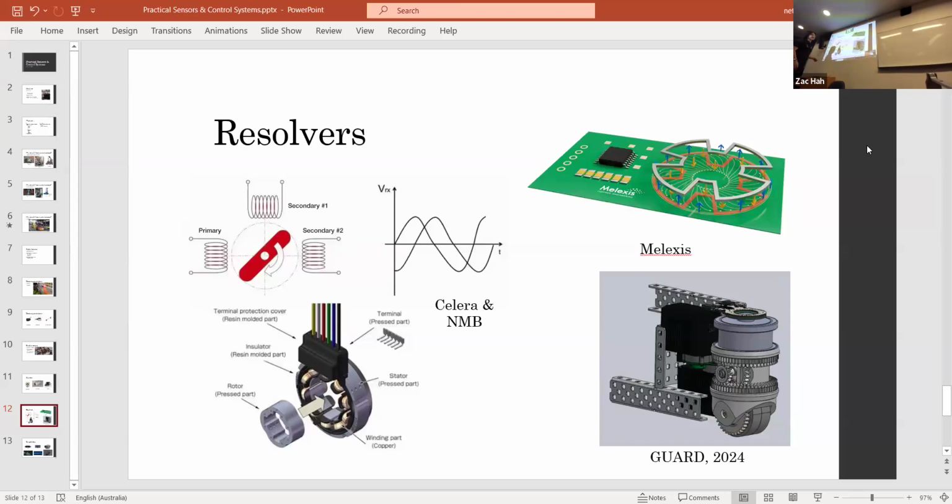Yeah. And so like the main advantage then, as you said, is that with a magnetic encoder, mag encoders can pick up noise coming from other electromagnetic sources, and on robots there are just loads of those like the motors, but this one is, it sounds like, way more immune to that noise. Yeah, that's right. So even things like the wiring, if you have high current wiring going through your robot, or if you have a big harness that bundles a lot of high current wiring, even that's not going to affect it. Oh, that's really interesting.